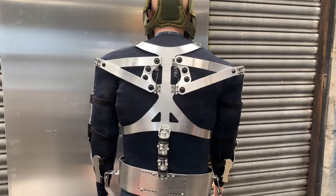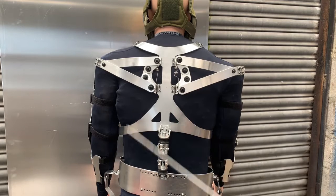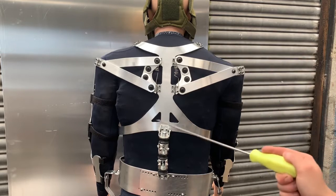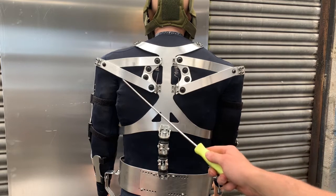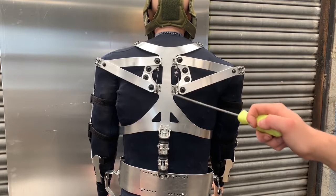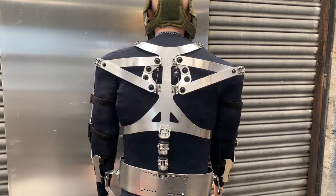Currently you have to slide it onto bolts and put your nuts on, but it will be buckled down on the next version. Lastly, onto the back — I've got a belt that mimics a weightlifting belt. For the spine, I was struggling to work out how much movement you actually need, because it technically needs to rotate on its own axis and bend sideways either way for full movement. At the minute it's just got little brackets attaching exhaust bobbins which provide quite a lot of movement — probably too much. It's got a simple frame that bolts onto the chest piece and bolts on at the bottom. The shoulders actually work pretty well, better than I thought they would. I do need to put adjustment into the bars because they are too big for me. I've also got hinges just behind the shoulder bars that allow you to pull your shoulders back, and more hinges on the shoulders which allow full shoulder movement.